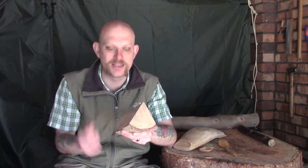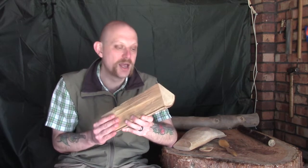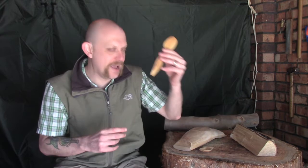It works with things like a quarter or eighth of a log that I've split down. If I'm making lots of spoons over a weekend, I'd split the log down and keep a bunch of pieces in plastic bags just to retain some of that moisture. When I work them down into spoon blanks and almost-finished spoons ready for finishing cuts and sanding, I'll leave them in those bags with wood chippings - sometimes with a few offcuts so the piece isn't sitting directly on damp chippings. Generally speaking, you always have to sacrifice a few spoons to the gods of carving, but most of them will survive.